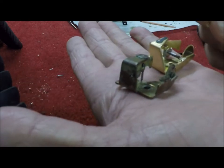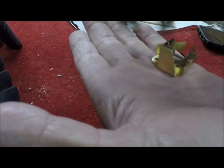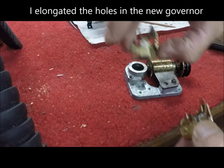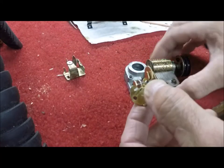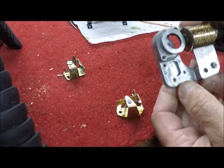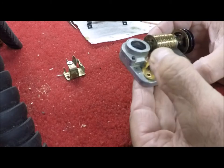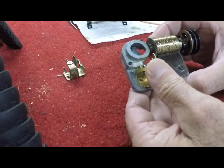but the frame was taller, and I just Dremeled this off of here. Now it'll fit in here, but I need to drill out these holes. The original one was slotted so I can move it up and down. This one's in a totally different spot, so I need to slot these out. Plus I need to clean this music box. This thing had this green, I've cleaned it some. I took all this comb off, which is not adjusted properly, but you can see that this wheel, now that I Dremeled this spot off, the holes don't line up, but it will fit up in there somewhat.